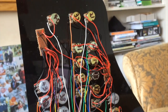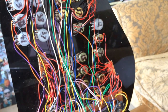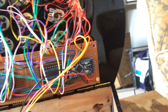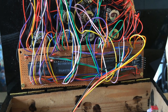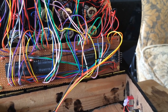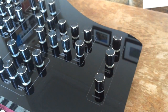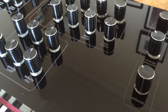The panel contains 35 regular potentiometers and 7 detented potentiometers as well as a toggle switch. Control scanning is done using an Arduino Pro Mini with three 16-channel multiplexers. The Arduino communicates with the BeagleBone Black via serial. The panel was completely new for this synth — it's made out of three-millimeter acrylic, produced using laser cutting, with all labeling and text done via laser engraving.